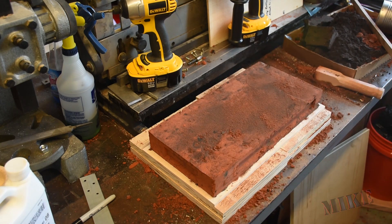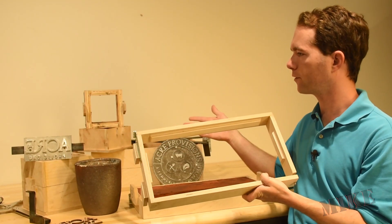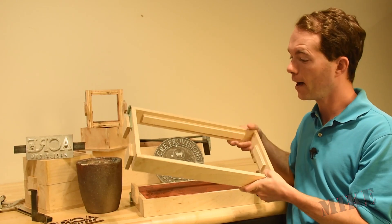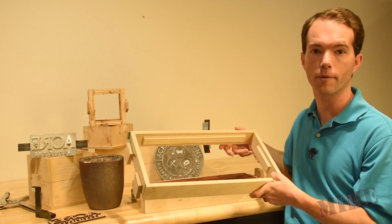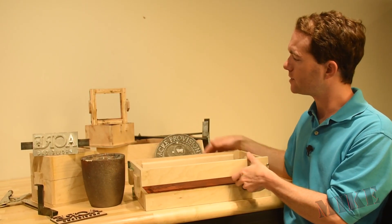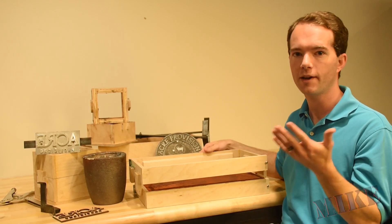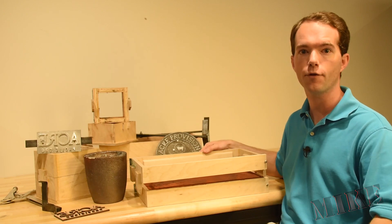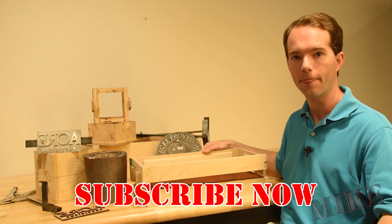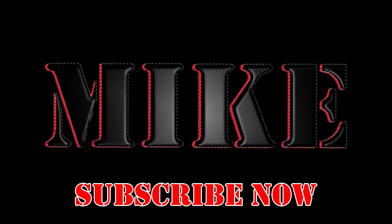Well, that's it — it'll work. It's much more complicated than the fixed flasks I have made so far, but now I'll be able to use one flask to make several molds and then pour them all at once, so that'll be nice. I'll make a deeper hinged flask soon using the same techniques. You can definitely do this yourself — just don't be afraid to try. Go ahead and subscribe if you haven't already. I'm Mike Thompson, and thanks for watching. I really appreciate it.